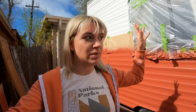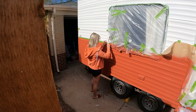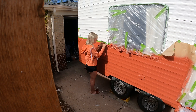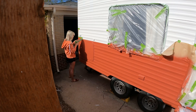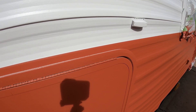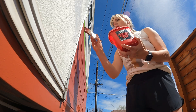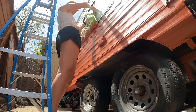The paint's been drying overnight and now it's time to take the tape off. I had a feeling we'd pull quite a bit of the white off in this process. If you're not already using Frog Tape for paint projects, use it. There was no bleeding — our lines were super sharp and very little of the white actually peeled off. Just a little bit around the corners, but it was way better than I was expecting after the whole rain debacle. I did some touch-ups around the doors and corners by hand before taking off the rest of the tape.